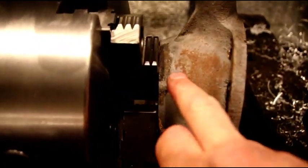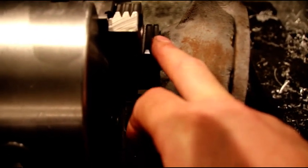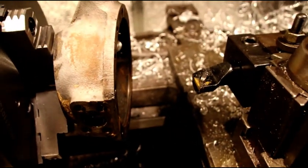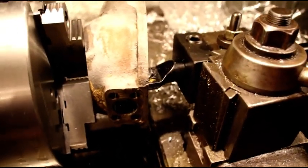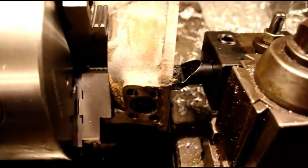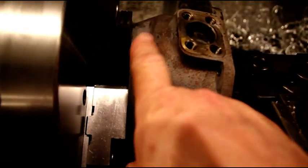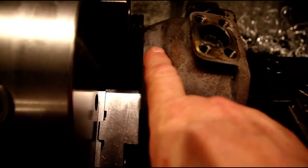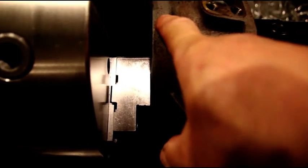Here's the first way. You take your spindle surface tight up against your jaws — you'll need a special set of jaws here just to bite that. And you're going to take your boring bar and send that guy in there. You are going to make a cut and flatten everything out and give plenty of room. If you do it this way, there's a whole entire groove cut. You have to be careful right here — you don't cut through. I've seen a lot of guys go through that and ruin their whole knuckle.